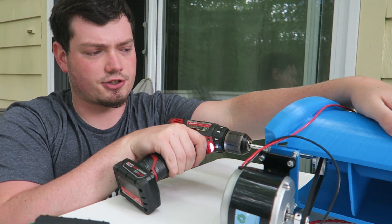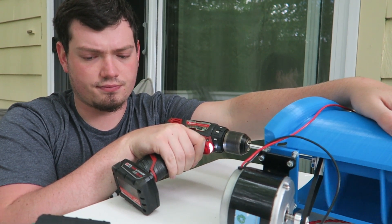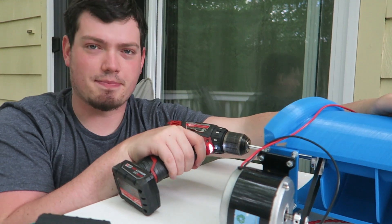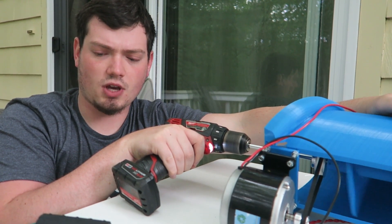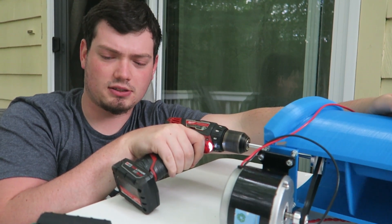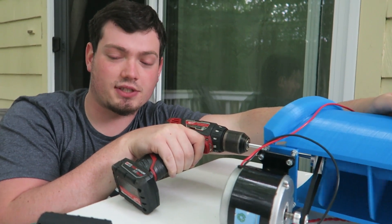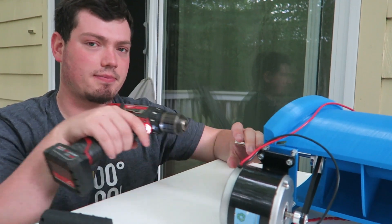In theory it should see a 50% increase in power at the same speed. I think I have to spin it backwards — I think that was the right direction. It just pulled 25 watts, same as before — maybe it's speed-dependent. Now with more speed: way more power! I saw over 50 watts — right now it's 54-55 watts, 13 to 14 volts at 57 watts.